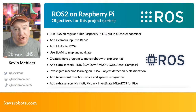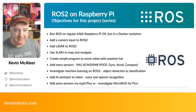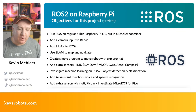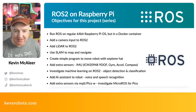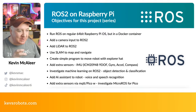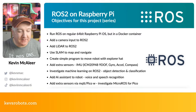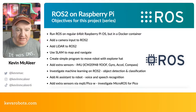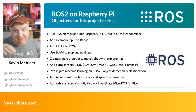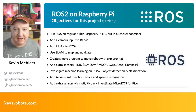I want to run ROS in a Docker container. You might think — why bother, why make your life harder? It's because we can develop the container, move it between different machines, and script how to build it so it's very reliable. If we just install things, we might forget later how to replicate it. By making it a container, I can share that script with everyone, meaning you can run the same thing I'm running, and it's easier to troubleshoot too.